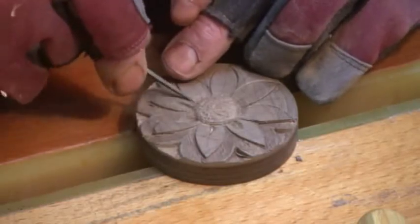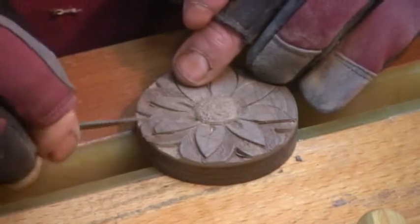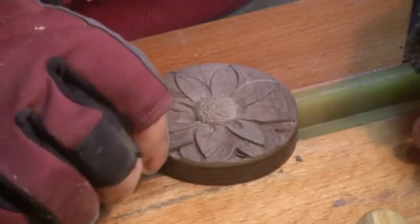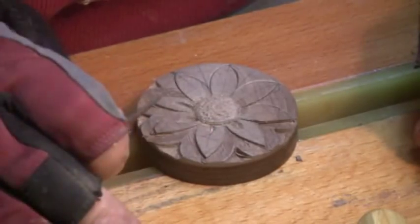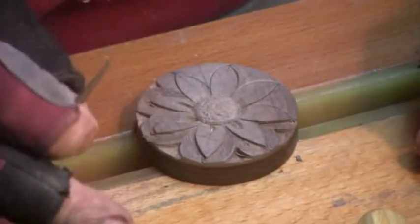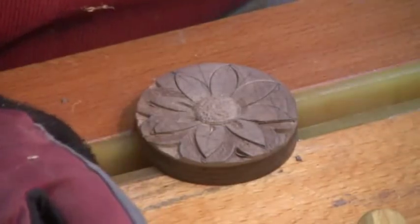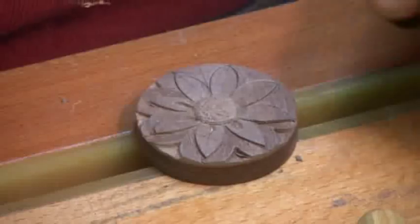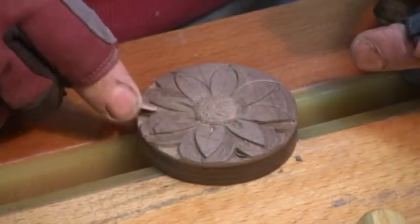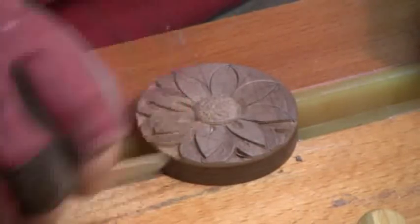It's nice to come in and just try to clean up a little bit — touch up your edges and corners and get all the little fuzzies off. One thing I want to tell you: don't get crazy sanding your carving. The little carving marks left in here from where you hand-cut it — leave them. It gives background and texture that makes it really look nice, and it lets somebody know you hand-carved it. If you don't have a file, an emery board — a little cheap fingernail file; they come in medium and fine — just cut them to whatever shape you want and get in there.